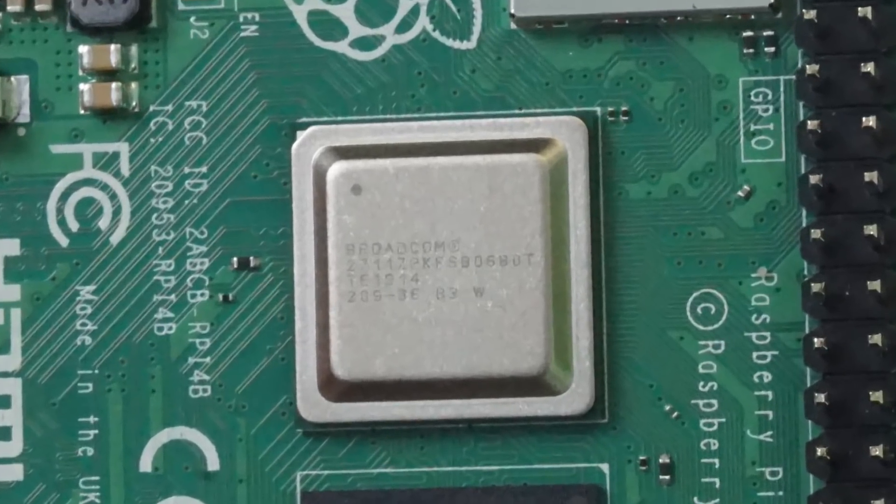The Raspberry Pi 4 is a huge upgrade compared to the Raspberry Pi 3 and 3 Plus. The CPU has had a major upgrade: previously it was a quad-core Cortex-A53, but now it's a quad-core Cortex-A72. These are two very different beasts in terms of performance. According to my testing, very broadly, the A72 setup is three times faster than the A53. So a Raspberry Pi 4 will be three times faster than a Raspberry Pi 3 — in the desktop, internet browsing, compiling programs, absolutely everything.